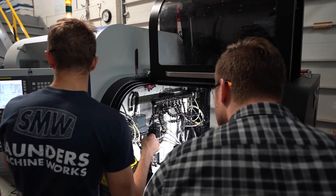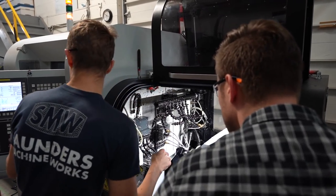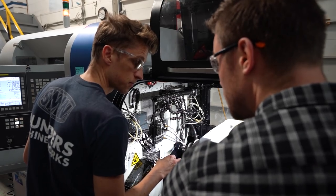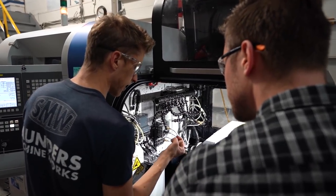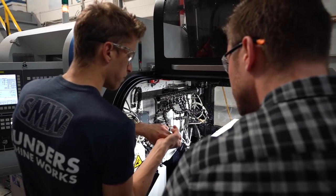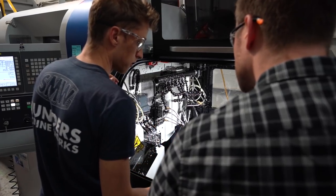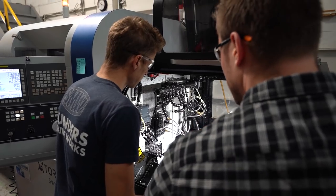And then for Zed, it's the material that moves out. Can that feed in and out as well? Not that we would necessarily need that, but you can feed out and then in again, or? So it's a guide bushing, right? So it's a very tight fit with the bar going through it. And if you turn the diameter smaller and then you pull back, you'll lose it. Yeah, okay. So you gotta be careful about that. You can go in and out a little bit for sure. Yeah, if you were machining, say, squat or something, then you... Okay.